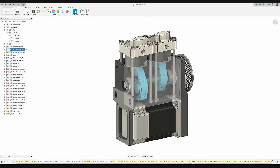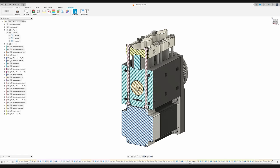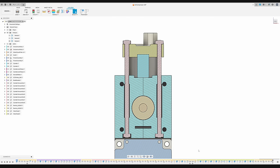Similarly, the load path in the 3D printed compressor body is designed to take compression forces only. The downward force from the crankshaft bearing is passed to the bottom of the casing via a short path through 3D printed material. From there, 4 M4 threaded steel rods transfer the load up to the valve head, closing the cycle.